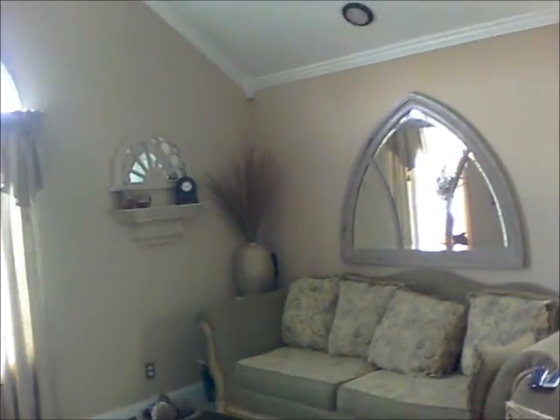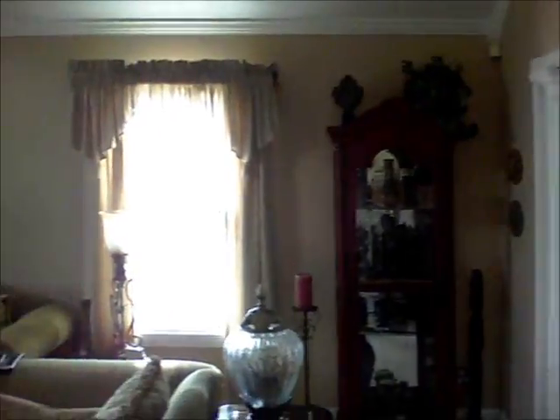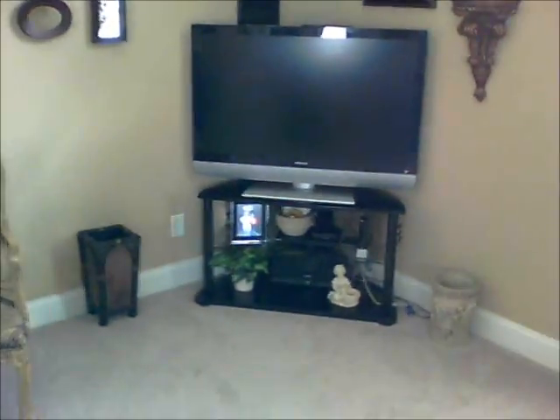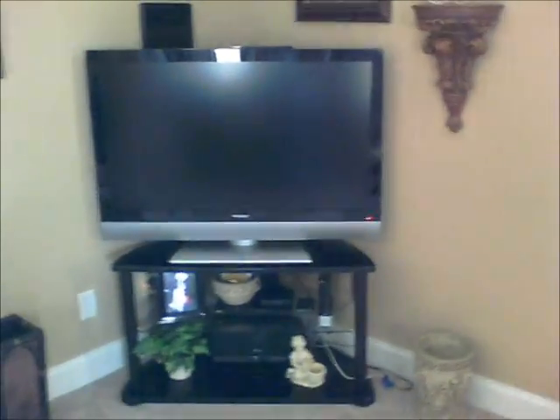Now I'll take you in the living room. When I started trying to put in solar lights I kept wondering what I was going to do. I thought about maybe mounting one on the wall, but my wife didn't like that idea at all. We kept watching videos and came up with an idea. I ran my wire for the living room, wall-fished it up through the wall from under the floor, and jumped it off that plug-in to one over here behind the couch. That way we've got a plug-in on both sides, and if the power goes out we just unplug from the commercial and plug into the solar. We still have TV.